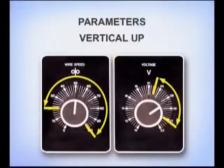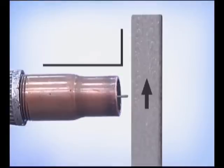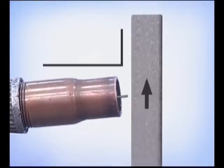For the vertical weld position, E71T1 is run uphill only. Set the voltage and wire speed in the lower range of the weld parameters. With the wire feed gun nearly perpendicular to the metal, maybe angled up slightly, try traveling straight up without any gun movement. Maintain a constant wire extension to keep the amount of heat at the weld uniform.